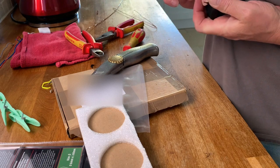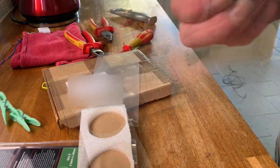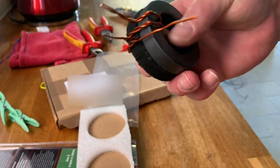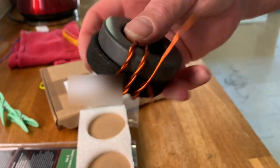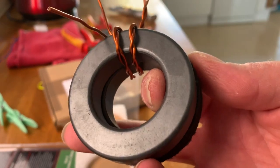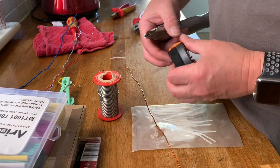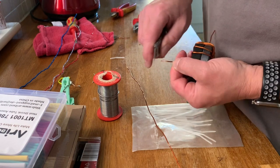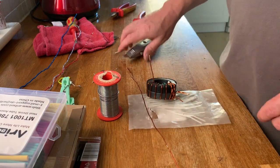Okay, start the winding. Don't forget that every time you pass the copper through the middle of the toroid, that's one turn. What you want is two twisted turns, and then seven single copper wire turns, then you pass it through the middle of the toroid and you make another seven. I'm making this from scraps of copper wire, so I'm having to solder another length on — this is actually the second piece of copper wire I'm soldering on to continue the windings.